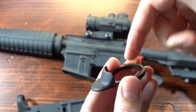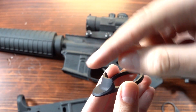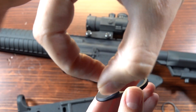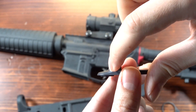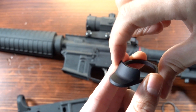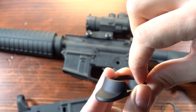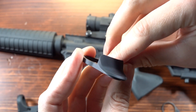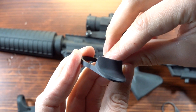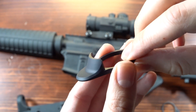We actually use a ball mill, which is a drill bit that instead of ending in a flat surface ends in a half circle. This whole beveled edge and this whole centerpiece is surfaced with the same ball mill. It was not easy — it took us a week and a half to both design and work out the tool paths for this. But I think the result speaks for itself.